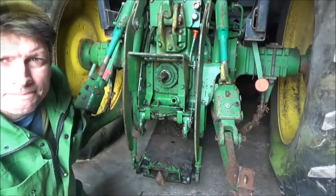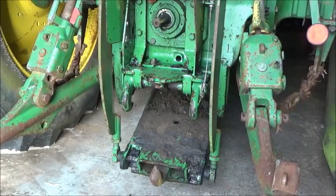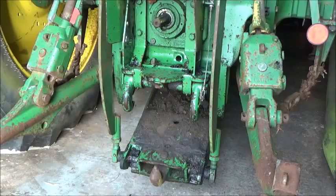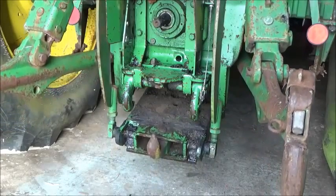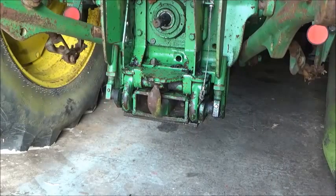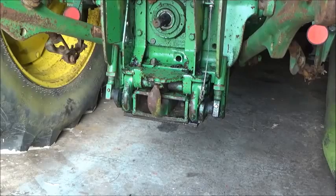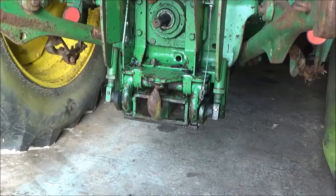Let's have a look and see if we can show you this hooking up. That's the hooks — I'm pulling the lever so the cable is moving the hooks out of the way. The hooks have gone in as you can see, they're locked. Now the arms come down and the weight is taken by the hooks.